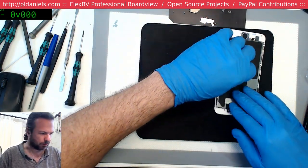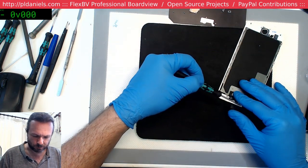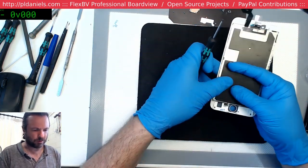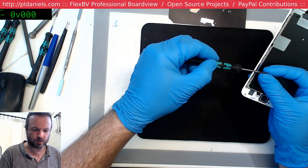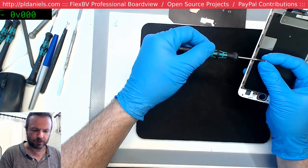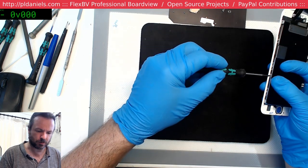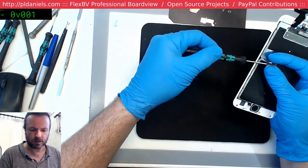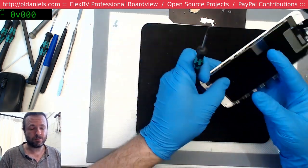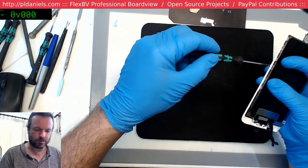I basically always use refurbs, given a choice, for anything 6 onwards. For iPhone 5S, 5C, or anything older, I go for a high-end aftermarket, only because the refurbs are so beaten up now that they're definitely worse quality than the aftermarkets. And yeah, I still get iPhone 4s here to fix, so they're not out of the queue yet.